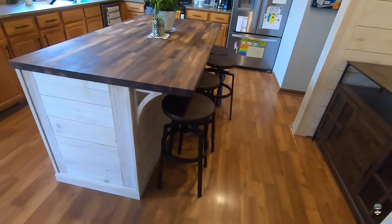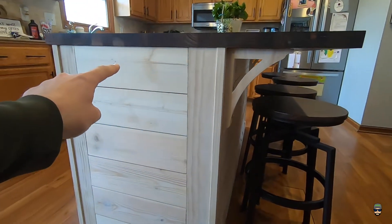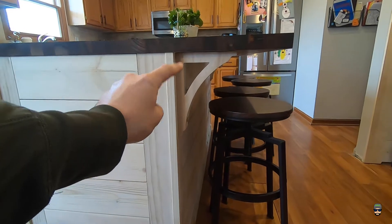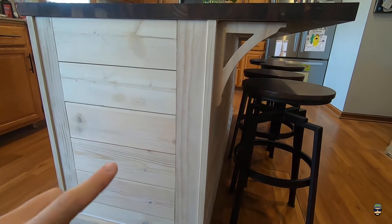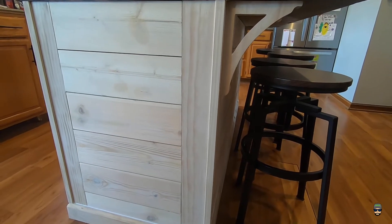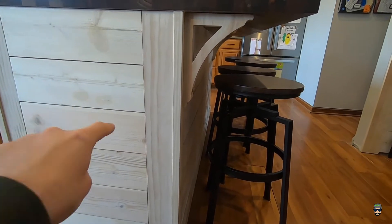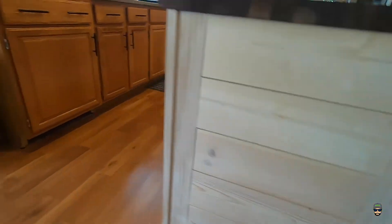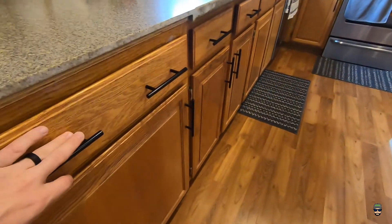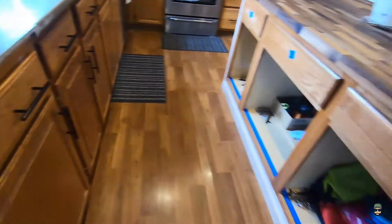I like to use one-by, which I've used here — this is one-by-eight. I've got the corner trim there. Here's our island, which I've also shiplapped or wrapped as well. This is one-by-six and one-by-four with the countertop supports. How I installed this is I put a little adhesive on the back side of the wood and nailed it from the inside of the cabinet out — traditionally you nail from the outside in, but it went really well. We've also installed our handles temporarily so we can use them until we start painting.